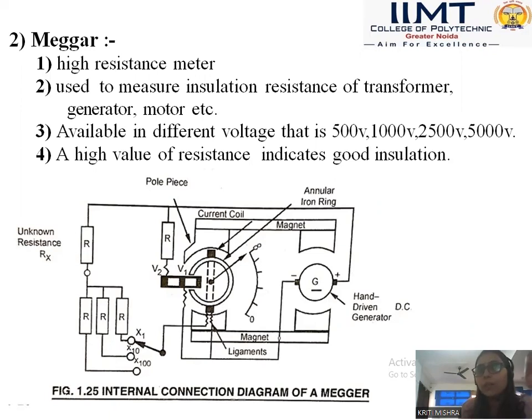When there is no connection, when the circuit is open, then we see infinity — the pointer is at infinity as nothing is connected, so we have infinite resistance. Megger is initially at rest and pointing at infinite resistance. When we connect some wire and another terminal with an insulating material, then we see slight fluctuation in some mega-ohms, which indicates the value of that insulating material. The principle behind this is basically electromagnetic induction.